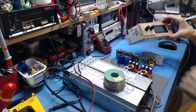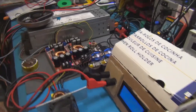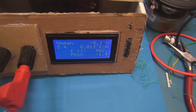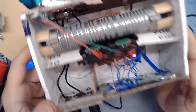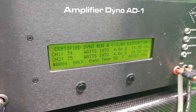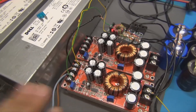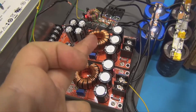The power meter is made from a sample power meter, modified a little bit to work as a dyno amplifier display. You can see the custom 4 ohm resistor to simulate a speaker load. There are two fans on it because this resistor can reach incredible temperatures. I have here two 12V 65A power supplies, one for each boost converter, but unfortunately one of them just burned.